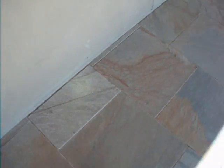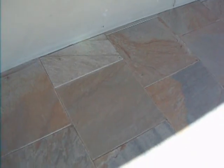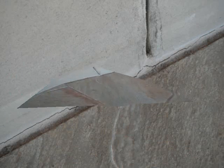Now normally, when you have a stucco finish like this, giving you the adobe style finish, there's normally a gap between the actual wall covering and the brick surfaces here, or the stone surfaces. And that's to allow water to run up against the flashings and harmlessly away. This particular part doesn't. I wouldn't recommend anything to be done at the moment, but it would be a good idea to seal along here with a silicone seal, just to prevent water getting in there, because over time that can cause quite a lot of damage.